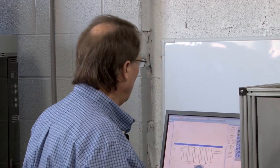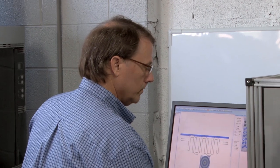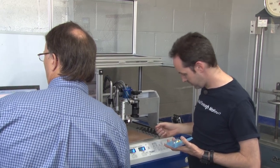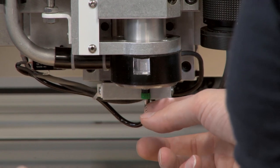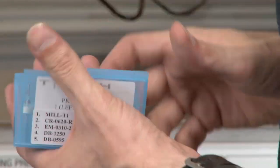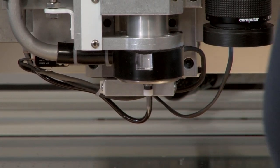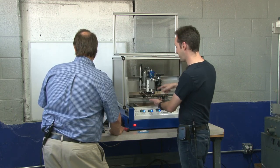You told me drill bit — you want to change it? Okay. Let's stop this layer. We need an end mill — I don't have any end mills. Let's get ready to release that drill bit. We put in a 32 drill bit instead of an end mill — I read the screen wrong, I believe. Open the collet. That would explain why it wasn't going all the way through. That's right. It didn't complain because it's a lot longer, but it sets the offset automatically.